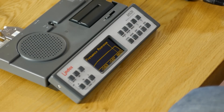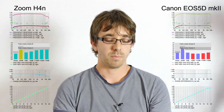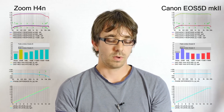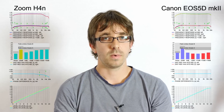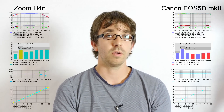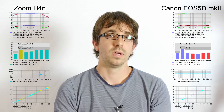Back to the frequency response — so what does that tell us? If we compare it to our camera's mic input, like the 5D Mark II for example, it's about 10dB better in noise performance. Though if you're prepared to run Magic Lantern firmware, you can get another 9dB out of the 5D too, and that's only 1dB off the H4n. Another advantage with the 5D is that you don't have the problem with high levels causing this intermodulation distortion.